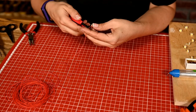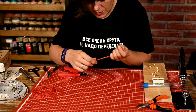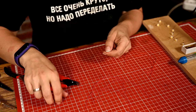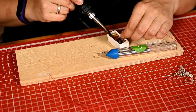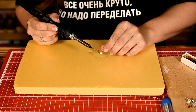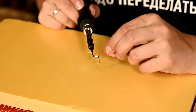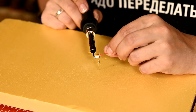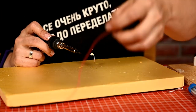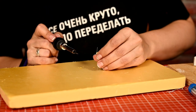After all the LEDs are attached to the resistors, you want to solder the wire to the other side of each LED. I'm cutting the wire into pieces about eight inches long, then removing the insulation on the edges and covering them with solder. Then I'm soldering the wires to the LEDs, placing the resistors into foam just like before. You don't need a lot of wire — maybe about a yard for the whole project. You can use wires from old kids' toys or Christmas lights for that. I'll leave links for all supplies in the description.